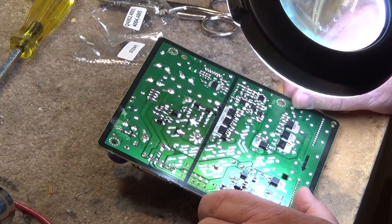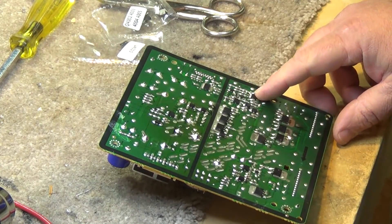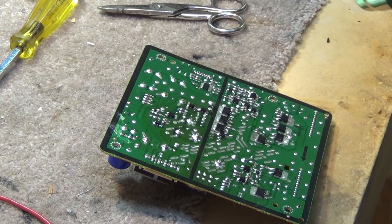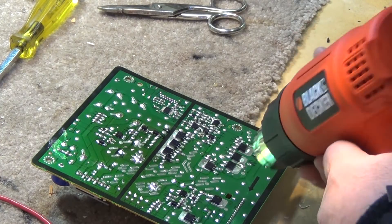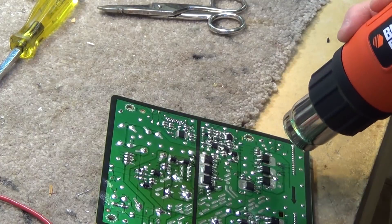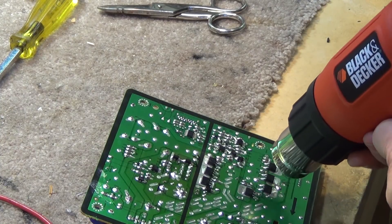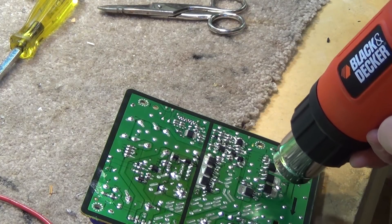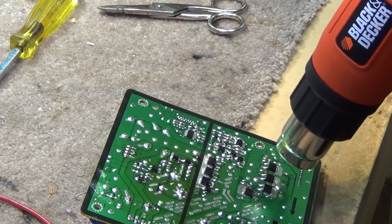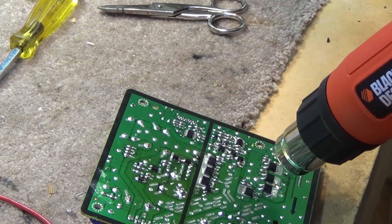So I'm inspecting the board now. The IC I'm going to change is this little one right here, and there are four transistors as well. The parts are actually all numbered in the bag. I'm going to change the five components on this board that have failed and get this TV back in service. We'll get the heat gun going on low and slowly heat the board up until the solder flows, then just lift the components off. Don't have the heat gun too close to the board because you can scorch it. Move it back and forth to distribute heat more evenly — watching for the solder to start to liquefy.